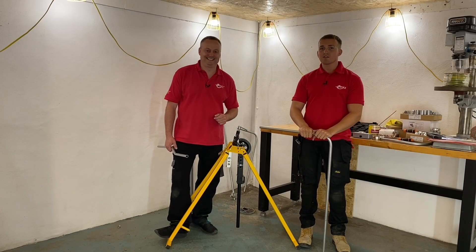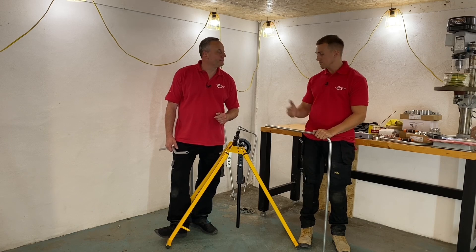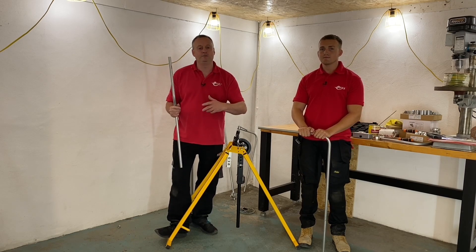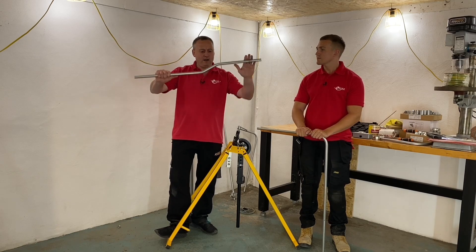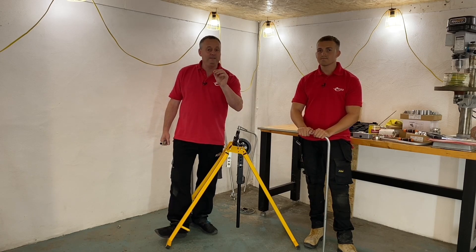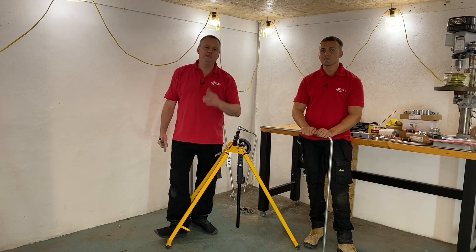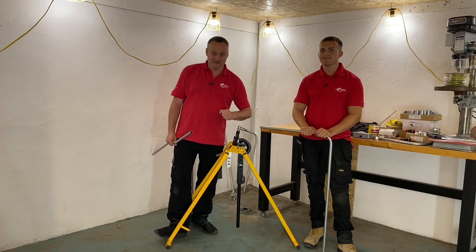You sent me a challenge of bending a length of conduit over one metre. You thought it was going to hit the floor, and I showed you how to overcome that - all we do when it's over one metre is reverse it. At colleges, a lot of the bends that students put in conduit are well under one metre. They get on site and find that the technique shown in the classroom doesn't work in practice. So thank you for showing that one metre technique. I always like to set a challenge at the end - so in the next video, I'm going to challenge you Jake to put a double set to exactly 50mm in a piece of steel conduit. Check out the videos in this series via the link in the description. If there's anything you want to see Jake do in this series, leave it in the comments.